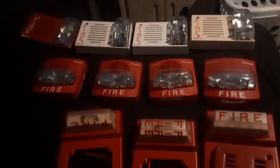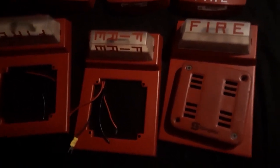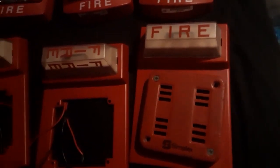Everything you see here is basically the 4903 series to the 4904 series. If you end up having one of these older 4903 series, you do not have to worry about it. They're all free-run by default, and these were produced for a very short time — around 1993 or before — before Simplex made newer ones. What I would look out for is the 120-volt AC series. Pay attention to the strobe; it looks thicker on that version. If you don't want that version, just go for the 4903-90101 to 90104. That's pretty much the plate for these.